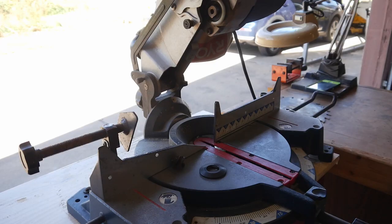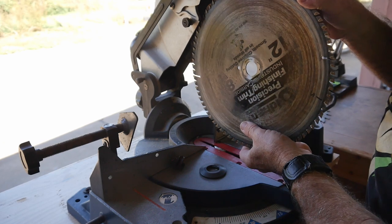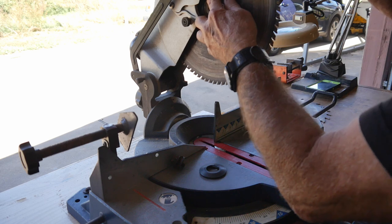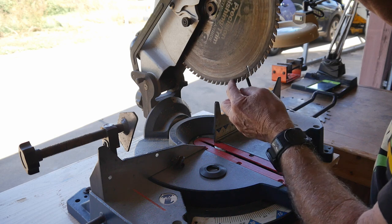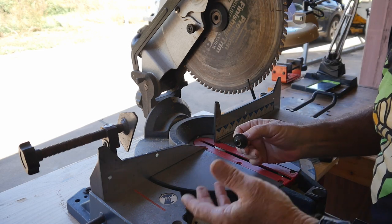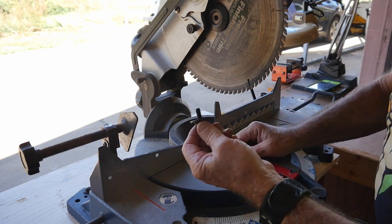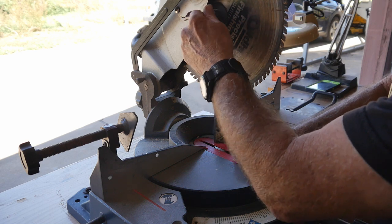Let's try this out. We're back at the saw. The same thing applies when we're putting it on — the first thing we're going to do is get the blade back up on the saw. Again, make sure it's not plugged in. You want the blades to be pulling material towards the back of the saw, so look at the direction of your teeth just to make sure you're putting it on the right way. No sense in having an accident. Because this is left-hand thread, I have to turn it like I'm going to try to take it off, and it's going to actually get tighter and tighter.